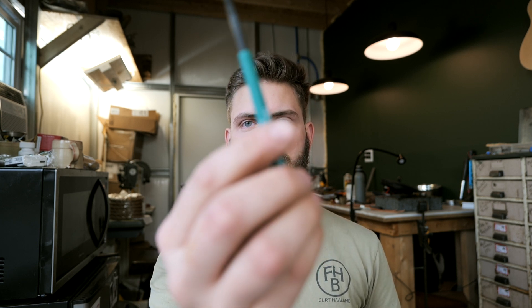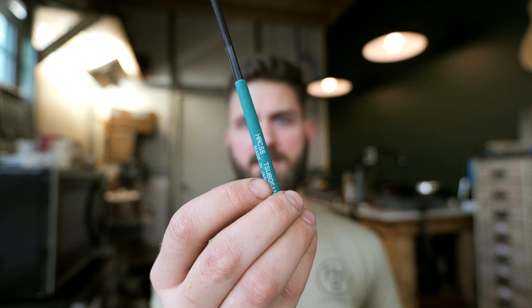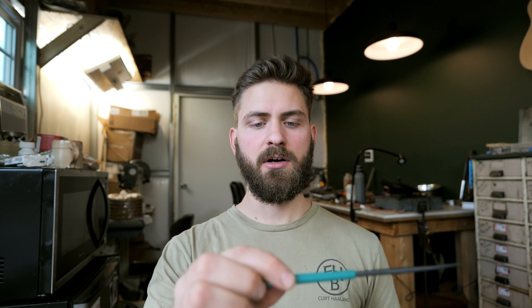If the 55 Rockwell tester digs into it, you might want to check and make sure you don't have any decarb on your blade, or try and reheat treat. You can follow specific heat treat instructions like you'll find on the internet, on different apps, or in different books. All that stuff is great and will get you reliable results if you follow those rules. But if you really want to check the range you're in, these are a good tool to have.